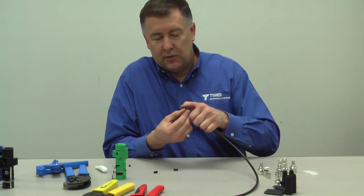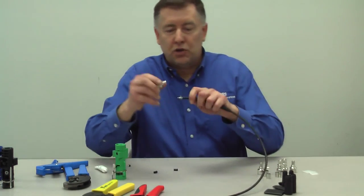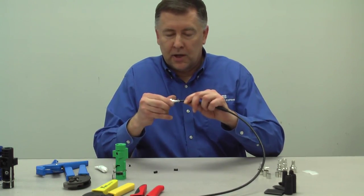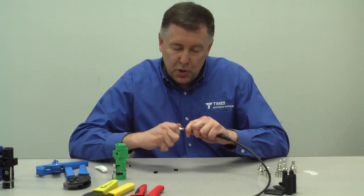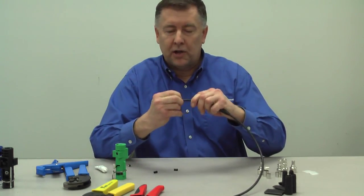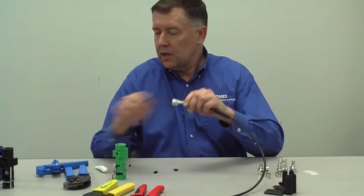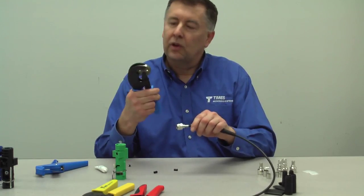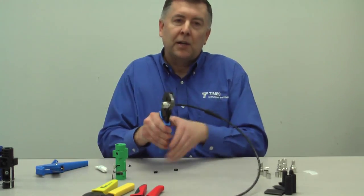Take the braid wires, you fan them back just a little bit. Take your easy no braid trim connector, get it started. You push it, you feel it stop. Give it a little extra push. Your fingers are riding up on the center conductor. Bring your ferrule back up, right where you want them to be. Take your crimp tool, proper size crimp die. You crimp it just once, right behind the back of the connector.